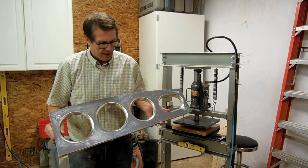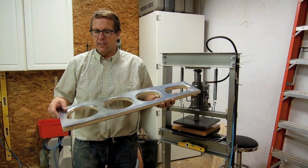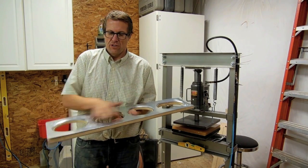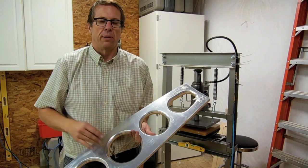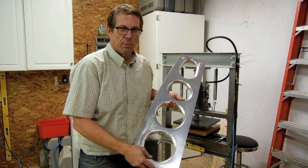As you notice, I now have four perfectly made flanges. The next step is to remove it from the jig and straighten out the holes a little bit. There are some stresses put in by pressing, and it causes the part to potato chip just a little bit. There's not a lot you have to do there — it's pretty simple to get that part done.